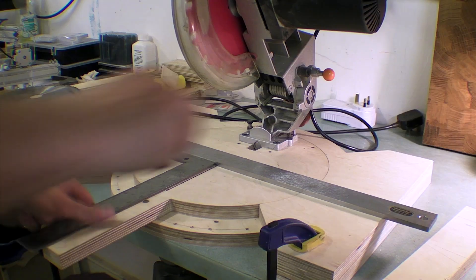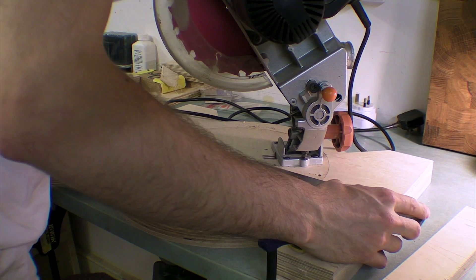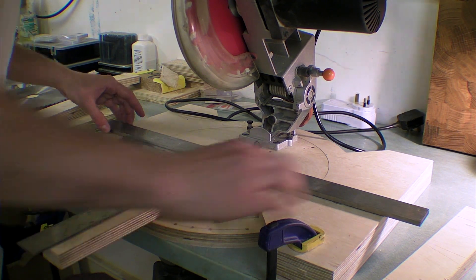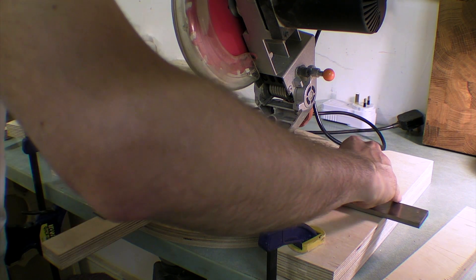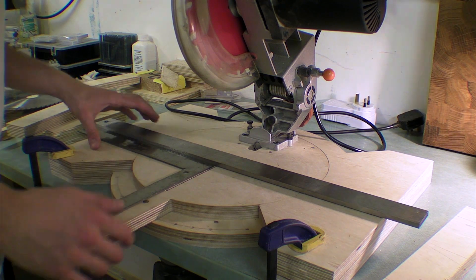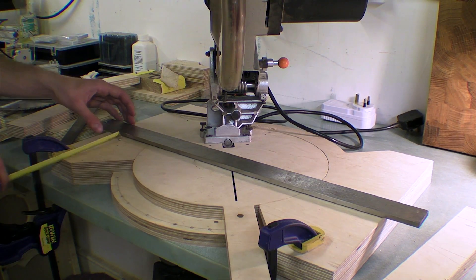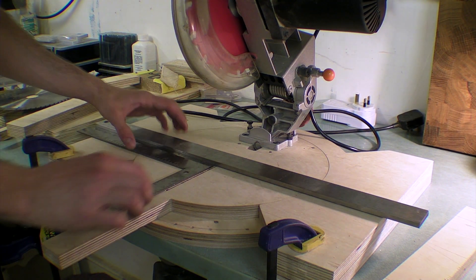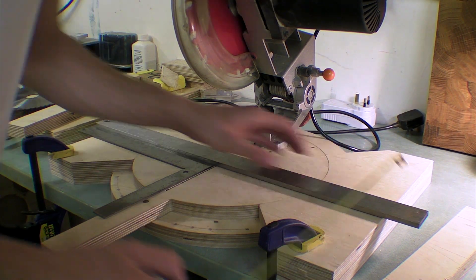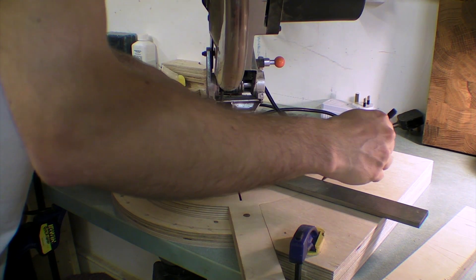To position the fence I used an engineer's straight edge raised upon some washers as a guide. I lined up the edge so the cut mark — a millimetre of which is visible — was closest to the miter saw hinge at the rear of the machine. I then moved the saw or turning component from left to right, making slight adjustments to minimise blade travel. I would bring the blade back to the 90-degree positive stop and check that the cut mark at the front of the machine was square with the straight edge. When I was happy, the fence intersected a part of the blade where I couldn't see any noticeable travel, and I drew a line along the back of the straight edge — which is where the front of the fence will be.